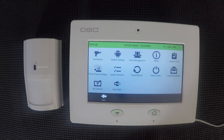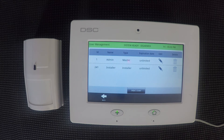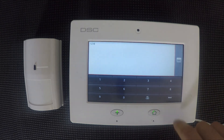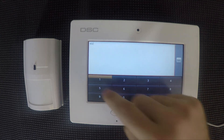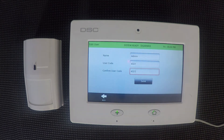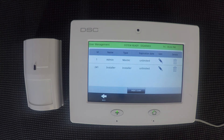After you're finished with that, you'll go back to the settings menu and the next thing we'll go to is user management. This is where you'll be able to add new users as well as edit any user information that's already in there. By default there's a master code and an installer code. You can edit the master code by tapping the pencil sign, then tap on user code, delete it out, and let's make it 4321. Confirm it with 4321 again, then done. Now we can see the user code and confirm user code match, so we'll hit save and the master code is edited. You can edit the installer code if you wish as well, but make sure you know what you change it to. If you forget it, it makes it very difficult to make changes to the system like adding or removing sensors.